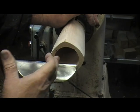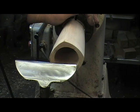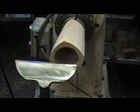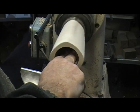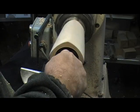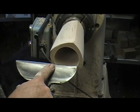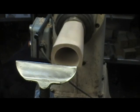I put a nice scraping cut coming down on the inside. I would sand that out a little bit to make it a finished piece — I get this foam-backed sanding pad from Vince. I could pick one out starting at 120 or whatever, bring the speed to about 500 or 600 RPM, and sand the interior out all the way to 320. Don't cut any corners on it. Now this is not a presentable edge right now — this is our original layout edge and we need to clean that up. For this, bring the speed way up to about 1500 RPM.